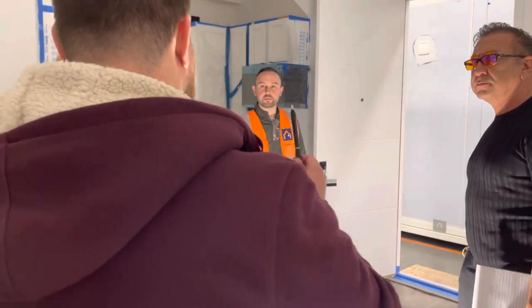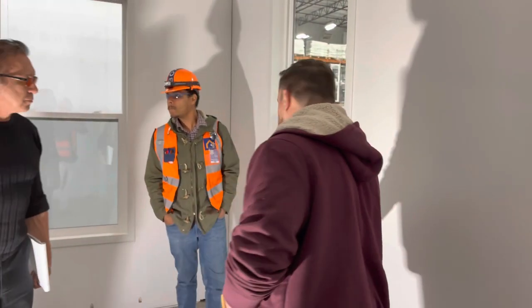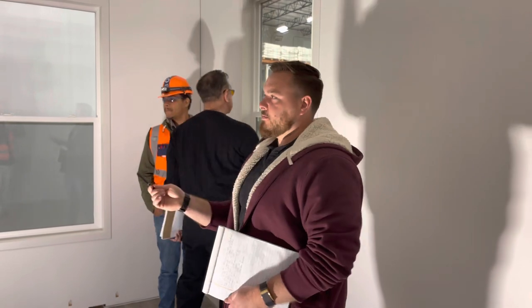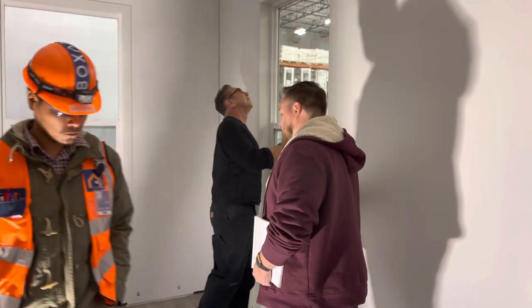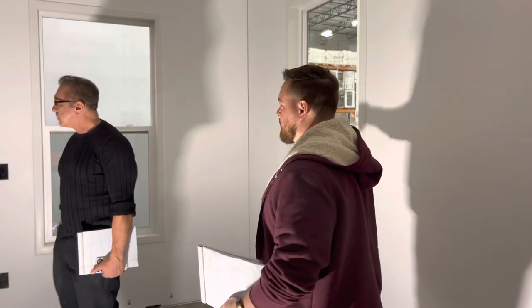I would say on the caulking and the trim, do a unit and we'll take a look, but I do not think you'll need to do any caulking on the exterior. When trim meets MGO, as a rule, you should not have to caulk. That's going to make a big difference. I will implement that tomorrow. When trim meets trim, or trim meets a window or a door, you'll probably still have to caulk that. But trim to MGO, you should not have to caulk. So that'll take down about 100 feet of caulk.